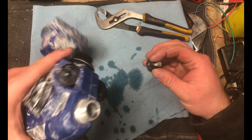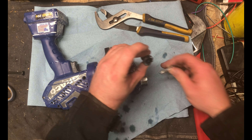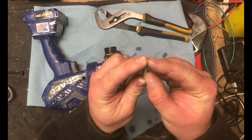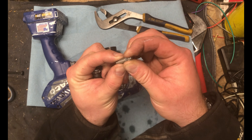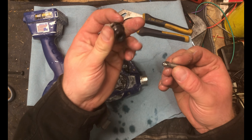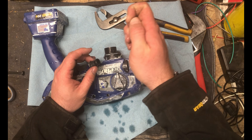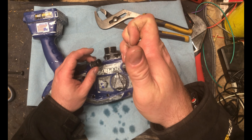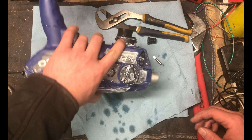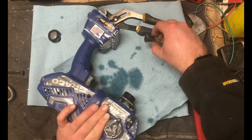Behind here there's a pin that faces on the orifice. As the pressure builds, it comes up around this pin and slides it back to allow paint to come out. When you stop spraying, this acts as a check valve - it pops forward and keeps paint from dribbling. When this thing is working great, it's fantastic - you can come right up to a corner, stop, move up six inches, pull the trigger and get exactly the same spray pattern. It's a pretty incredible tool, worth every penny.